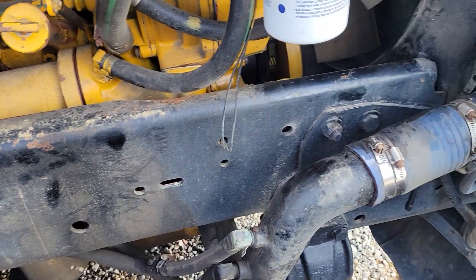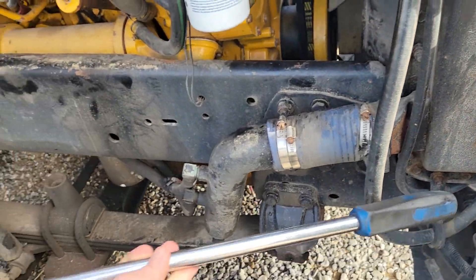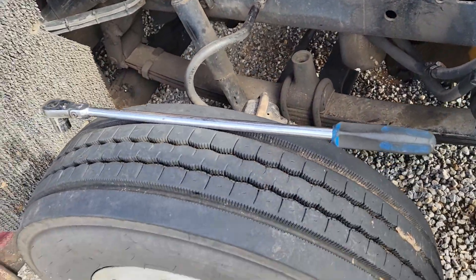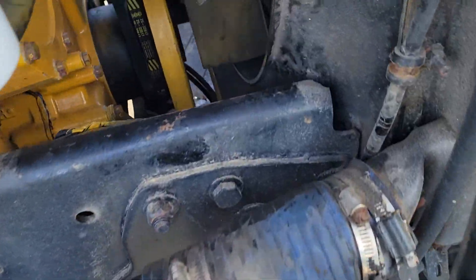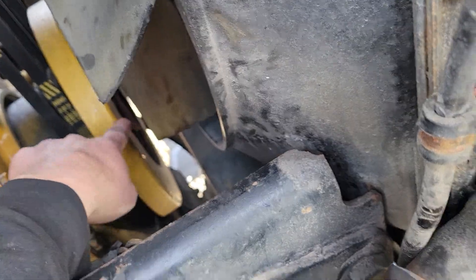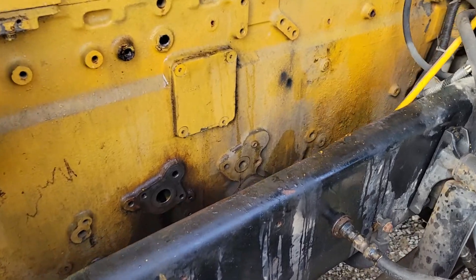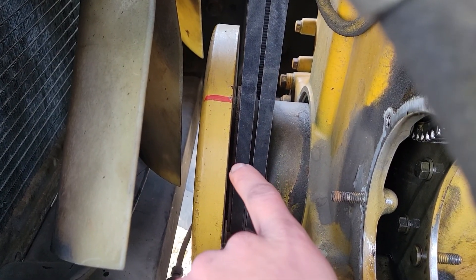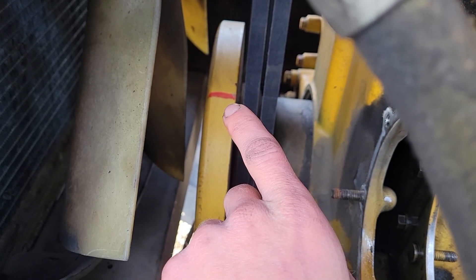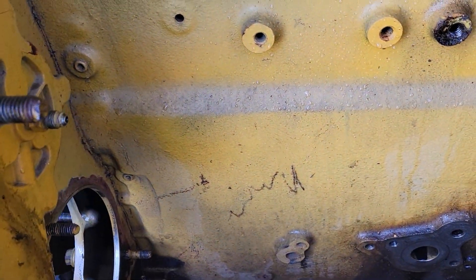You can advance it and make a little horsepower, but that's stock location. So we just put this bar — it's just a Cornwell ratchet, 15 sixteenths. It only needs to be six point but that's the sockets we got. You put it on one of these front bolts and you can spin the engine. So you get the flywheel and the pump, you're able to pin them, then you can pull the pump off. And the engine builder — I mean, that's how fresh my engine is, it's not even really dirty yet. So this is just bullshit. But he put that mark to line up with the belts, it's just kind of what he does, so that works out, helps me.